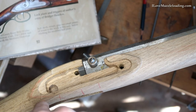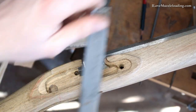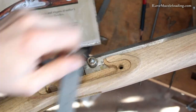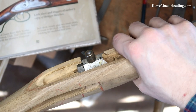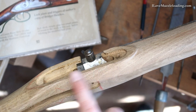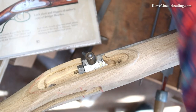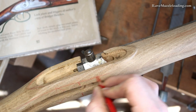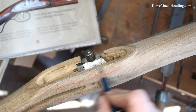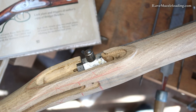So you'll see in this original or recreation of this original, we have a pretty narrow mortise there. That's something I want to take note of and kind of work towards. I've popped out our assembly underneath here so we can focus a little bit of work on narrowing this area up on the underside of this lock mortise. Right now, looking at it kind of from the top down, we have a little bit of a fish belly there — I want to go after that just a touch. I know we talked about lining up our guard assembly down here. What I'm making a note of doing is to take a face, kind of looking at this in a polygon sense — I have a face here and a face down here and our center face. So I'm trying to work just this face out here, establish our narrower mortise, and then I'll work on blending that into our guard and plate assembly down here.